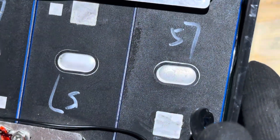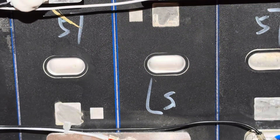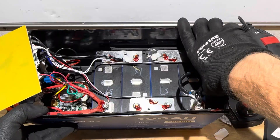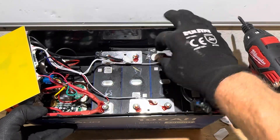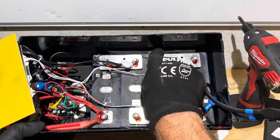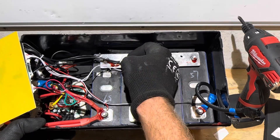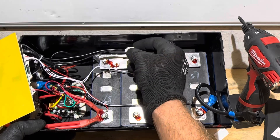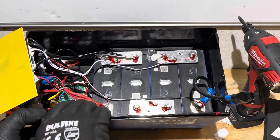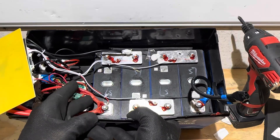I did notice on some of these codes you could get a few numbers off of them, but I'm not even wasting time trying to identify the manufacturer. Just complete junk. Going through and checking everything for tightness, making sure nothing else is loose, all the balance leads are good. There's a high temp thermal switch — not a sensor — there's a sensor glued down right there. That's a high temp thermal switch for the heating function. It's on there, but it wasn't the greatest, and it was on the bar instead of at the cell level. There's number seven — look at that. It's got thread locker on it and it's so loose, you just barely touch it and it's moving.